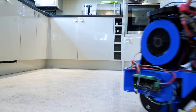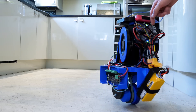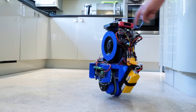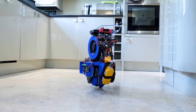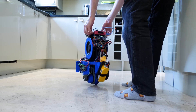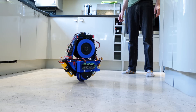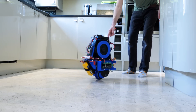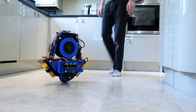The batteries are positioned quite low down to exert a force to balance in the side-to-side axis. However, that's not ideal for the front-to-back axis, which really wants a high mass at the top of the robot for high inertia so it doesn't move around quickly. But this has been a really good test to check that this method of balancing works, and I'm really happy that it balances on one wheel and can almost stay still.